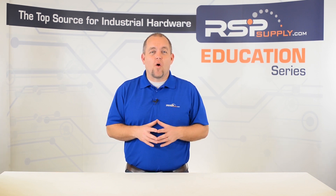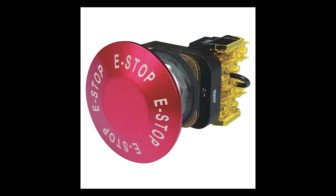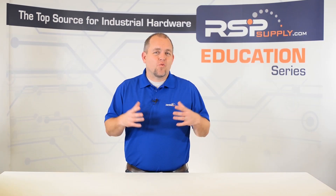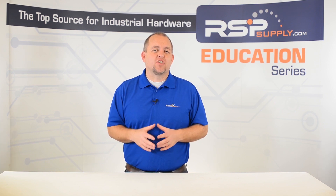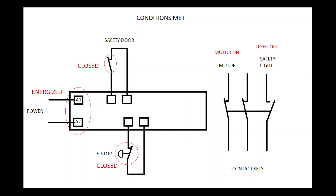These open circuits can be wired to just about anything. So using our example, one of the circuits could be wired to an e-stop that, when depressed, will open the circuit, thus de-energizing the relay. One of the other circuits could be wired to a safety door that requires the door to be shut in order to close the circuit. So if this were the case and we wanted to fully energize this relay, three conditions would need to be met. First, the relay needs power — this can be with a controlled circuit or no control. Next, the safety door would need to be shut in order to close that circuit. Lastly, you would need to ensure that the e-stop is not depressed, or that it is in its ready state. In this position, it will enable a closed circuit.